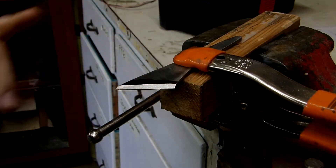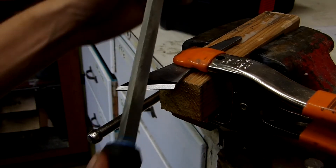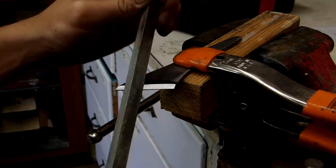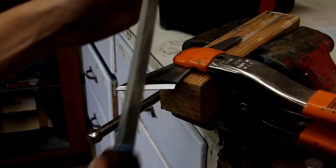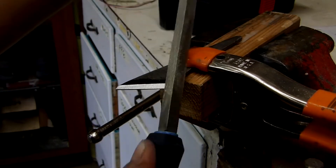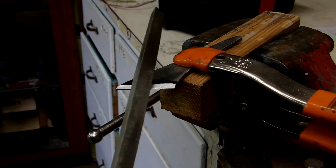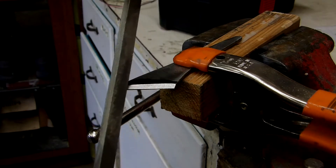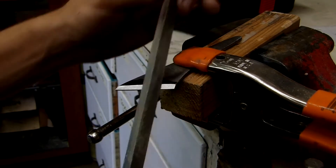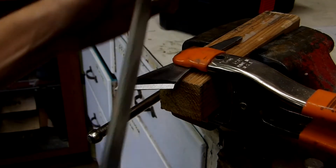This is just the primary bevel, so I'm not too concerned with it right now, because we're still going to go back and do some more filing and grinding after the hardening and tempering, and then we're going to put a secondary bevel on this. But if you have a light, you can always tell from the way the steel catches the light what the angle of your chisel is at, how far off you are, and how to fix it.